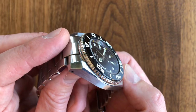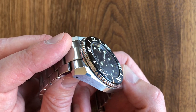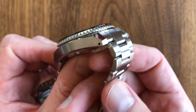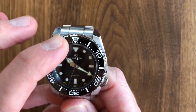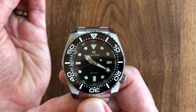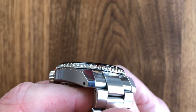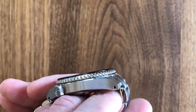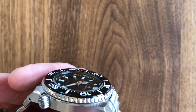If you search hard enough, you'll find all sorts of examples of ceramic cerachrome bezels shattered. I just don't think ceramic is best suited for something that gets banged around. I don't wear mine in really harsh environments, but I would wear it swimming or at the beach. I like this steel insert. These inserts are really interesting — all the Grand Seiko divers have some version of this kind of insert. They actually fit into a kind of crush gasket just like a crystal. You would insert a case knife, the bezel would pop out, and there'd be a nylon or Hytrel gasket holding it in place.